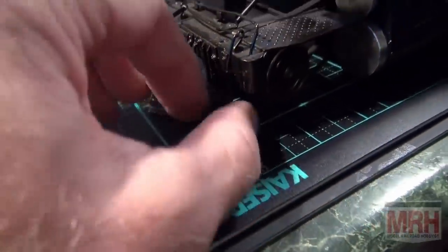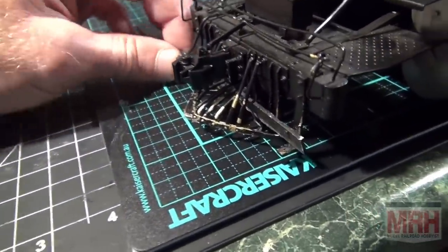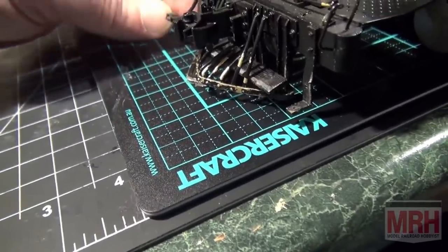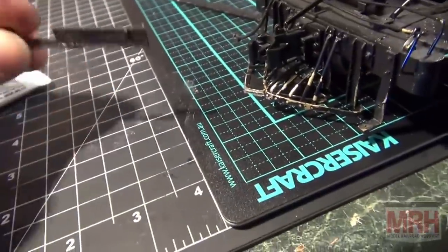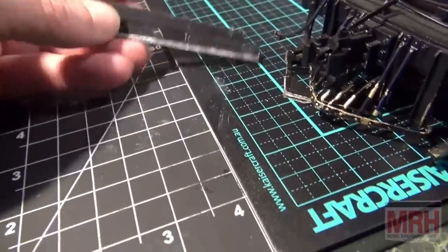And this is where the resistant soldering rig absolutely, there's no other tool that could do what we're about to do. Because the whole point is to heat up the area around this brass without the rest of the cow catcher falling apart. And if you look, these are some very heavy pieces of brass for running boards that I'm going to have to put in there.